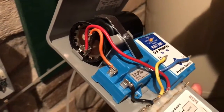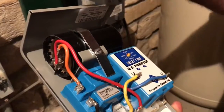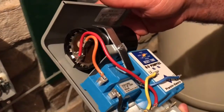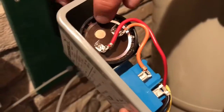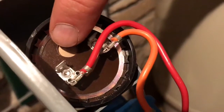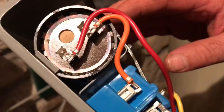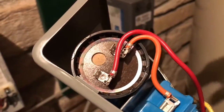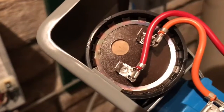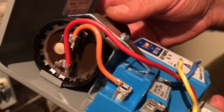The capacitor's job is to give the pump a shot of electric power to get it spinning. If electricity were just applied to the pump motor with no extra boost, it might not get going. So the capacitor kick-starts the pump, and this is one of the things that can cause a pump to stop working. There are methods of testing a capacitor — fairly complicated — but if this circle on top is bulging, broken, or exploded, you know your capacitor is bad. They're not very expensive; unclip it and take it to an electrical supply shop or order online. Before you touch the contacts though, lay a screwdriver across them — if the capacitor is charged, you can get a shock. It won't kill you, but it won't feel comfortable.